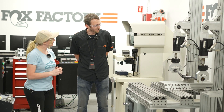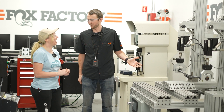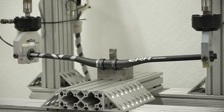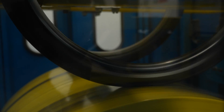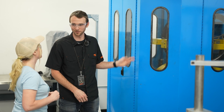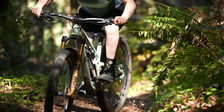On cycle counts, carbon bars basically don't break on this test — we'll break stem bolts, the bolts holding the bar to the stem, and then just have to replace them and keep running. Then there's another wheel machine — a bit more complicated. It actually drives the wheel with a chain, putting drive forces into the hub. Especially for e-bikes with very strong motors, we need to test for those loads. It also does a rocking stage, so we can get sideways cornering loads as well.